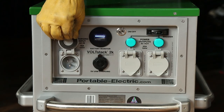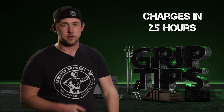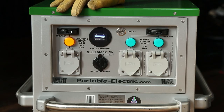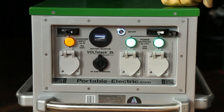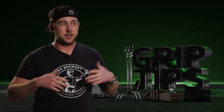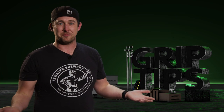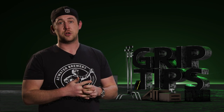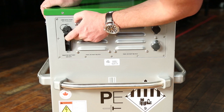You have two receptacles available to divide power as you see fit. You also have a charging port, and I think it's impressive that this unit can charge in only two and a half hours. You also have two 5-volt USB charging stations to power things like your phone. From here you press the on/off button, then flip the breaker and the two green indicator lights will come on letting you know the outlets are now live. That's it — as super simple as it gets. There's no gas to add, nothing like dealing with a suitcase generator. It's just boom, here's 20 amps of power. To power off, follow those instructions in exact reverse: flip the breakers off, tap the on/off button, then head to the back and turn the master battery switch off.